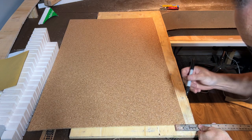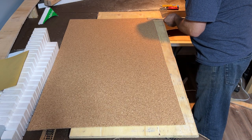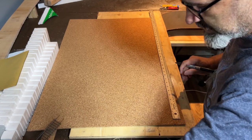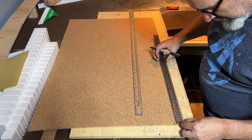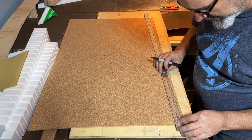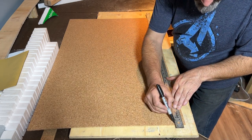So let's start by cutting the strips to the right size. I'm going to go for one and a half inches. Measure one and a half inches here and the same at the far end. Before I draw a line, let's put some track on just to make sure we've not gone too skinny, because you're going to lose a bit of the top when you sand it down. Now that'll be fine. Let's cut this and continue this line across so we know where we're cutting. It doesn't need to be perfect because we're going to be sanding it anyway.